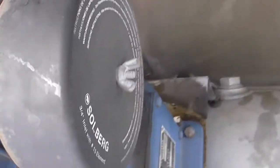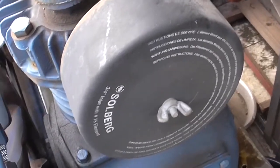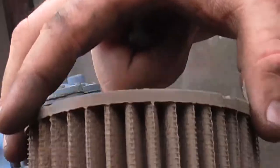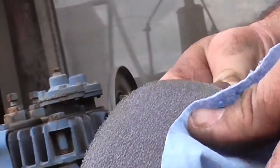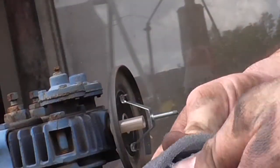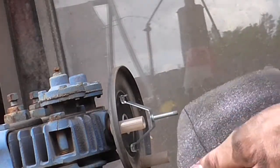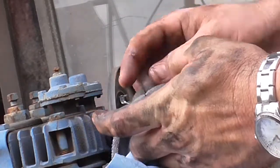I'm going to change the air filter. I think the most important part of an air compressor is having a good air filter. Now with these pre-filters, a lot of times you want to put a little bit of oil on them — just try to coat the outside in oil to help attract any particulate.